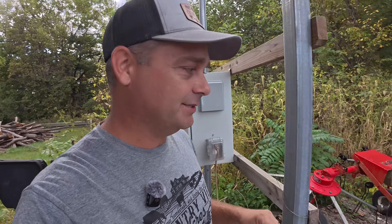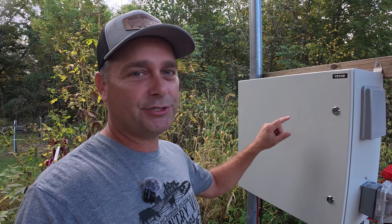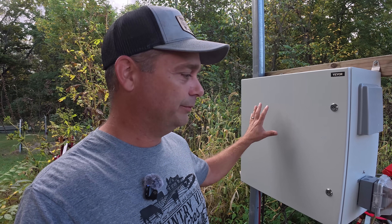The other thing I'd suggest is probably adding a second battery. We just have the 100 amp-hour 12-volt heated battery, and I think a minimum of two would be better. Right now I'm using this as a light continuous load just to test it, but if I was running that well pump again I'd definitely want more batteries — maybe even more solar panels. I probably won't do another update on this system until we have some sort of problem or relocate it. If you're interested in building an enclosure like this, I'll put a link to the original build video in the description. Hope you guys have a great day and I'll see you in the next one.